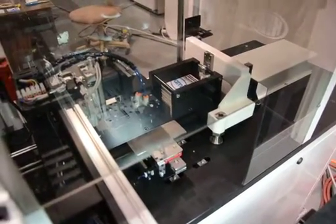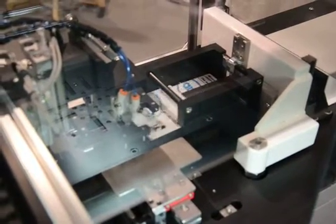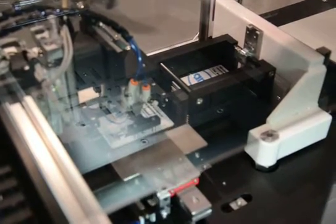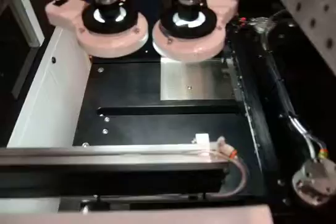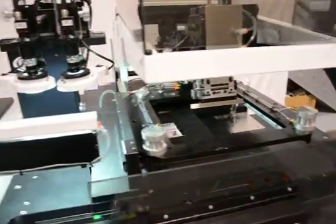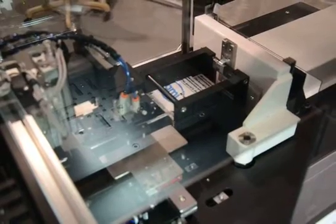We're almost to the position of the beginning. The cassette stops and the pusher pushes one part out. The substrate will be snugged. The edge gripping head will grip the substrate by the edge and place it onto the screen printer. The screen printer will auto align, make a print, and flood back. The loader then grips the substrate, now printed.